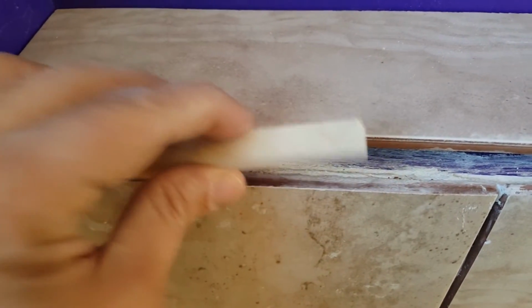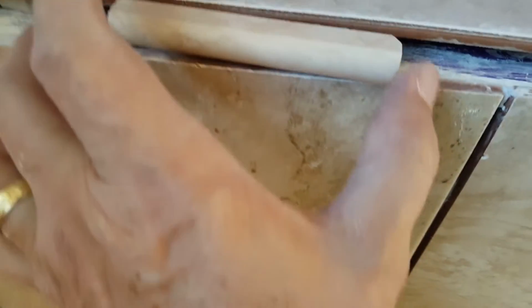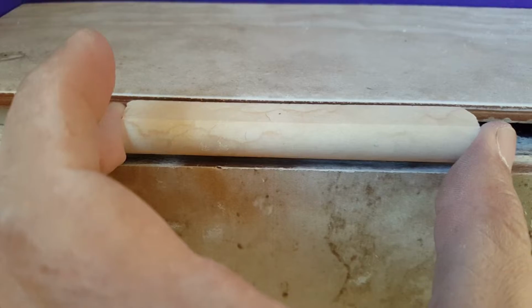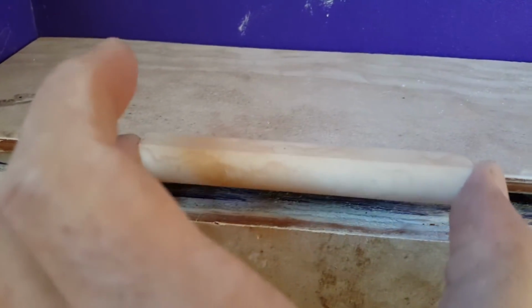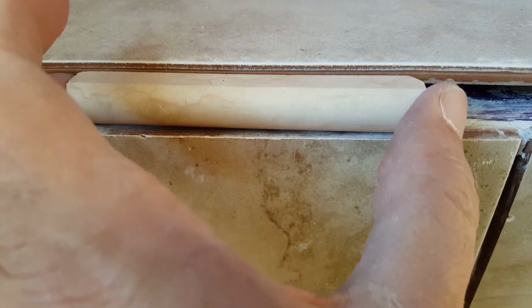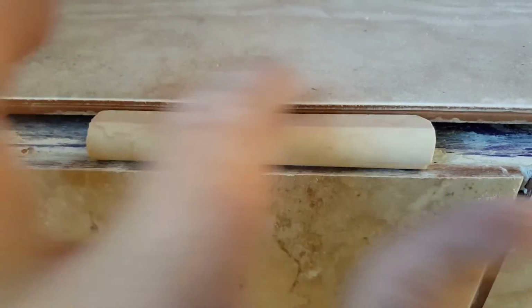we had to leave room to be able to put our little frame piece that we're going to use here. Now keep in mind the frame piece is going to be elevated up slightly, so we'll have a little grout line like that, see? And you always want to make it so that this is either higher than or at the same height as the pencil piece, otherwise the water won't drain off, right? You don't want the pencil piece being above it like that. So that's why all that planning is so critical. And so everything's going to fit kind of like this, and we will have a grout line right here.